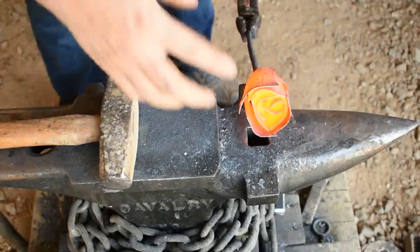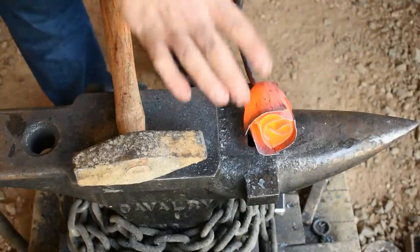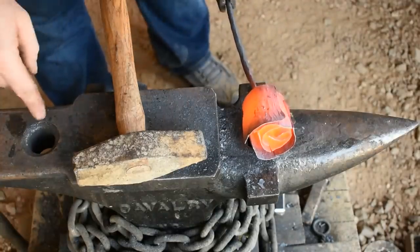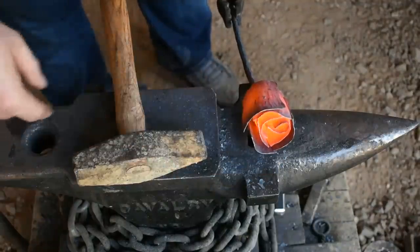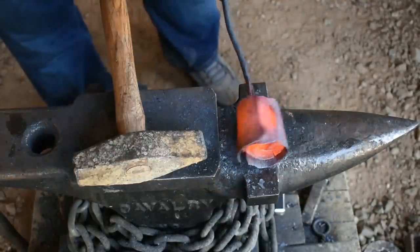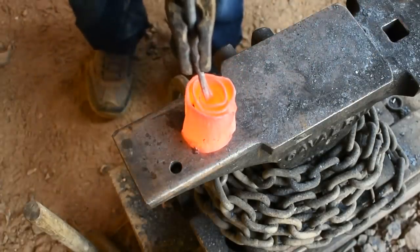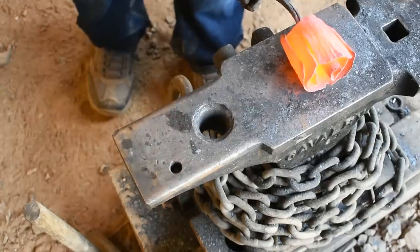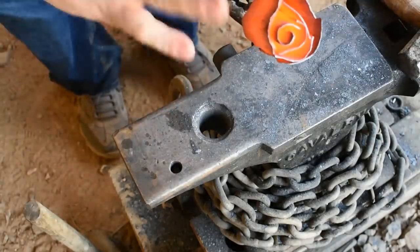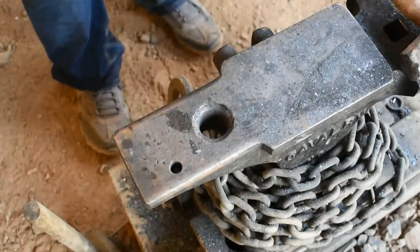You see how the center of our rose is down in the middle? I'm going to come over here to this hole on my anvil, put the stem up, and hammer on the stem to push the bulb of the rose — the eye of the rose — down some to bring it up above the rest of the petals. Literally just a couple of taps to pull all of that up. There we go. Then we'll go over to the vise, heat this up, and start straightening everything around — making it look more like a rose, a little bit more organic.